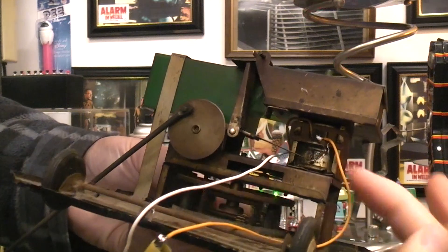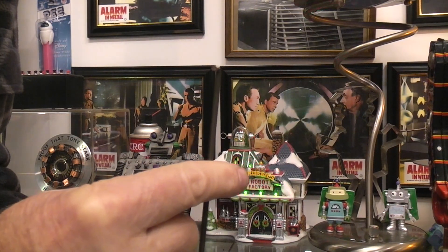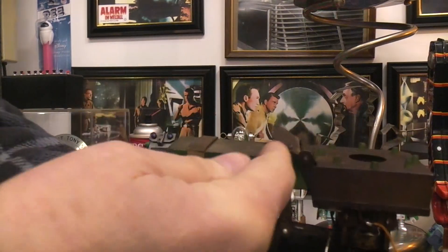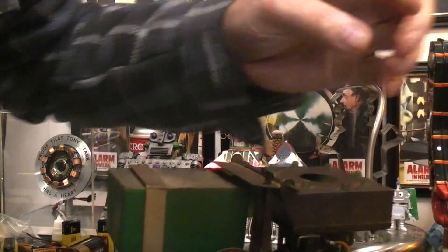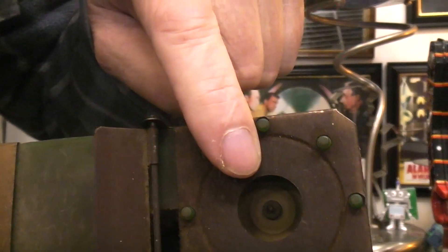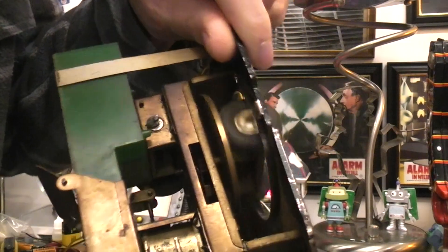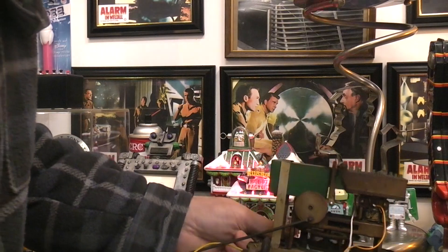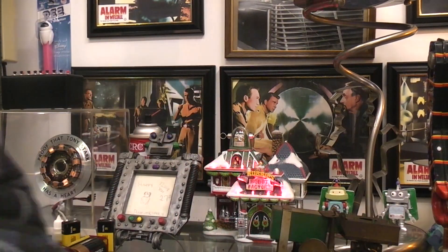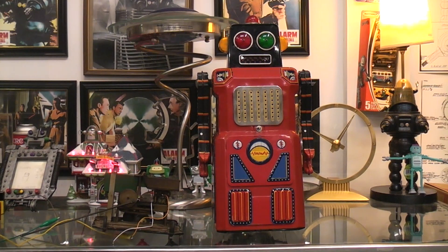It's the flashing switch — this is moving the arms up and down. You can see how that shaft gets longer and shorter. You can do it by hand too. So anytime you let the air pass through there, the whistle would be on. The fan is down in here. The bump-and-go drive — and of course you can see the motor. So if you ever wanted to know what was inside the Sonic Robot, Train Robot, or even any of the very old bump-and-go battery-operated train toys that whistled like that, now you know.